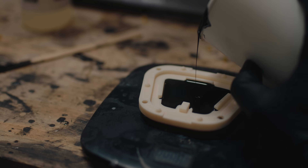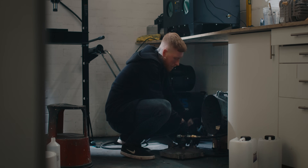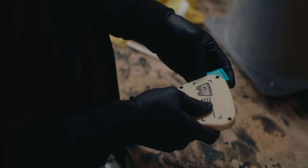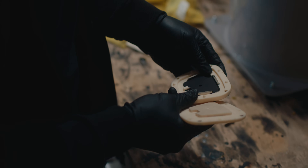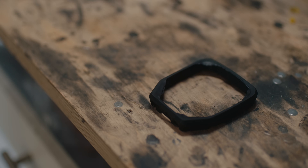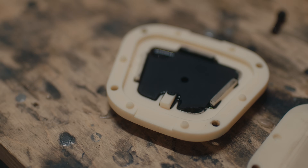I can do the same for the base mould, bolt them together and get both into the pressure pot. I'm mainly using this for the base pad to eliminate any small air traps caused when I poured the resin over the fine text and details. Now these have cured, I can demould them and see if they've worked — and they didn't. I got air trapped in the mould because of the way I put the second half on. Without thinking, I put the mould half on parallel to the other half, whereas I should have angled it to push the air out, similar to how I angled the mould when pouring the silicon. To add insult to injury, I also forgot to put mould release on this side of the base mould, so that's stuck in there and that mould is now scrap.